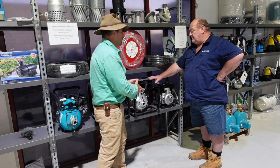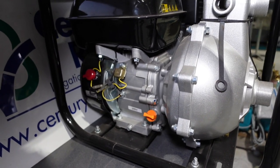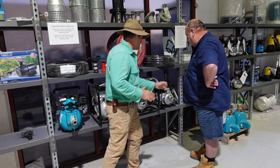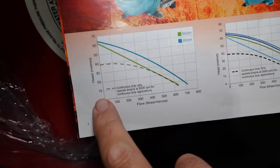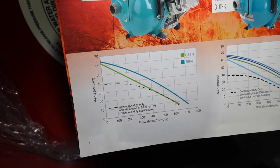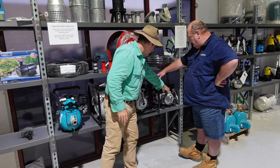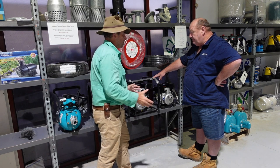There's a big jump up to the next one — it's almost double in price, but you're getting double the performance. The head on this one is 62 metres, so for tall trees, buildings, whatever you want, it's going to spray. When looking at data on pumps there are two important things: your flow and your head. Your head is how high you can spray, and you want to be somewhere in the middle for longevity. I also noticed a difference in the outlet manifold — on the budget pump you've got a single option, but on this one you've got two smaller and one larger outlet manifold, which gives a little bit more flexibility.